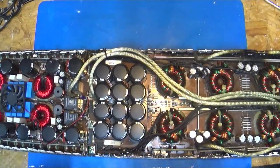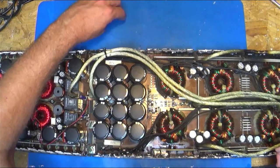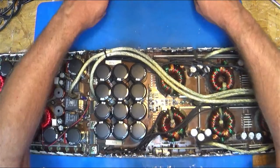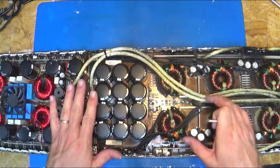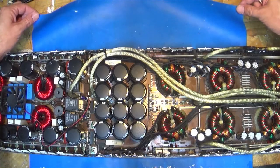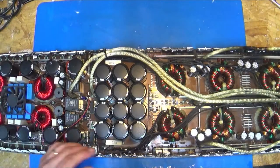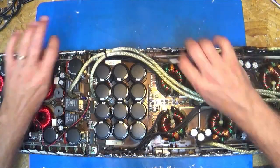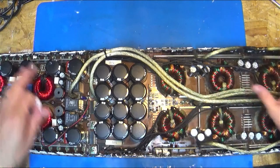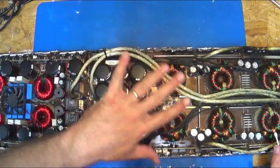That's why I use flat silicone mats, not those work mats that you see. The flat silicone mat allows me just to slightly flex this board up, and then it slips and slides on my work surface, so I can move big things around without putting as much strain on them. Pro tip to get flat, these are silicone baking things for doing fondue and cakes and cookies and stuff. That's why I get the flat one instead of that one with the compartments and stuff you see a lot of the guys do. This allows me to use my bench and slide stuff around, whereas I think that other mat is designed to not slide.